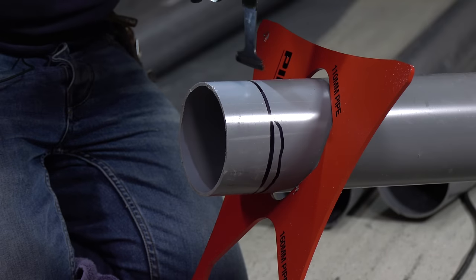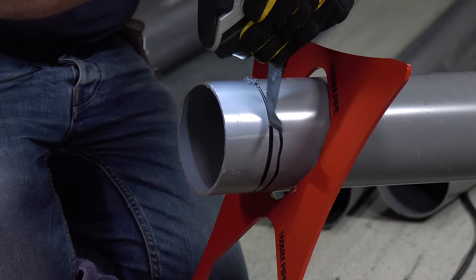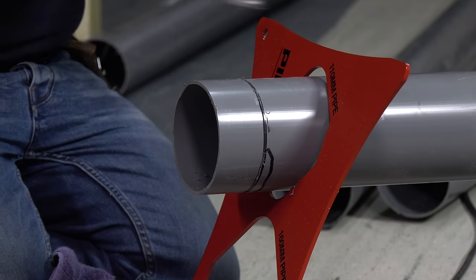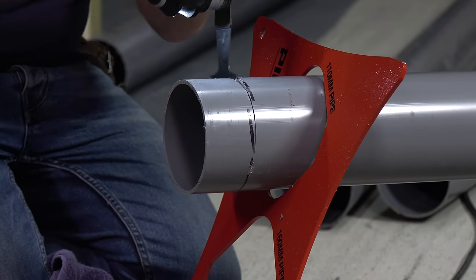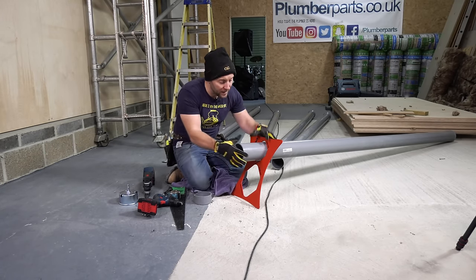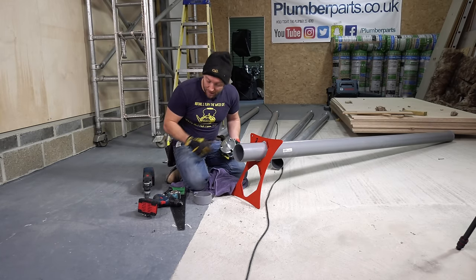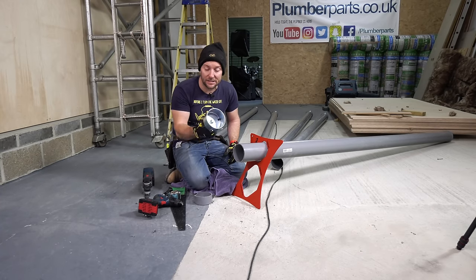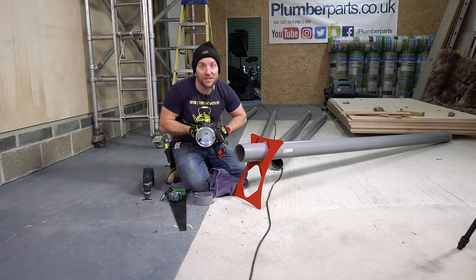You can see exactly what I mean here - how much easier it is to do this job when you've got a nice stable surface to work on. It's just miles easier, miles neater, and a lot quicker. There we go - that's cut off. We've solved the problem of how we stabilise this pipe to cut it. Now the next thing is to eradicate the need for that file. The pipe chamfer is a really, really easy, simple product to use - that's why I think it's great, because the easiest ones are the simplest ones.